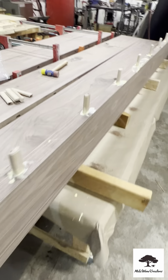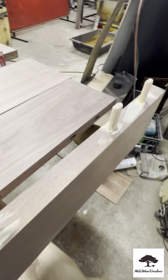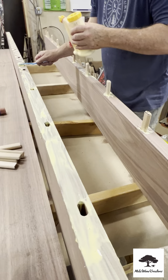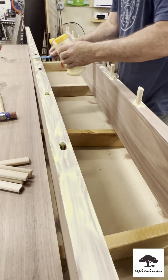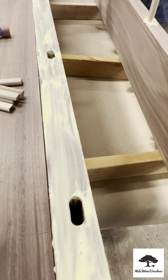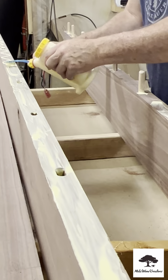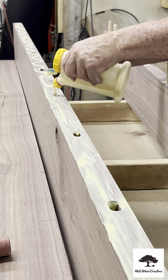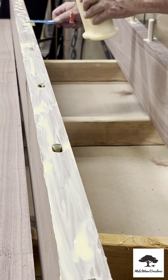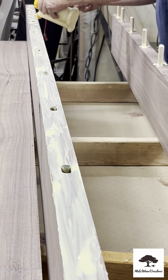Okay, so we have all of our dominoes. Now we're going to go through the process of putting the next board on — you'll see how simple this becomes. Matt's lining up the mating piece. He's putting glue in the hole — enough to cause squeeze out. You just play around with it and you'll figure out how much it actually needs.